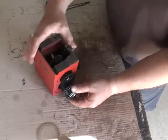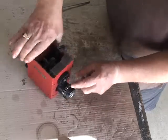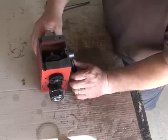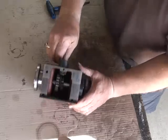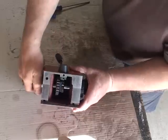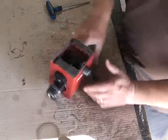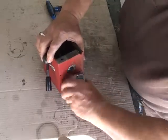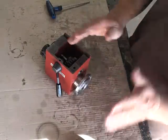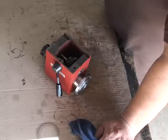I've now completed the assembly of the box. I've put the gear at the back here which drives the thread-cutting section of the lathe, the drive shaft, and the high-low gear mechanism — one way and the other way. It's a little bit tight; I believe that with these taper bearings you've got to run them in a bit for things to loosen up. Taper bearings will move out slightly depending on how tight you've made the locks, so it'll have to be done with the motor running.